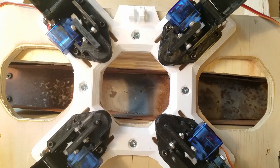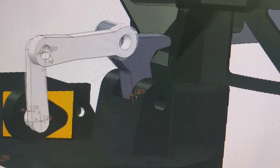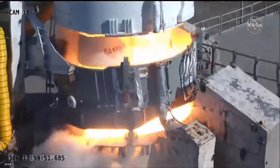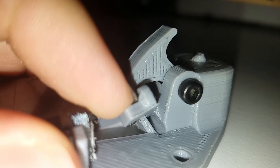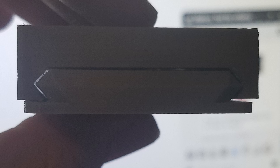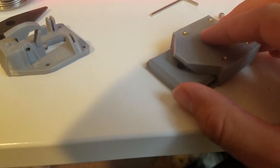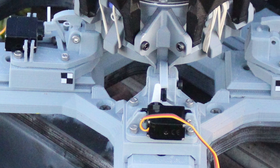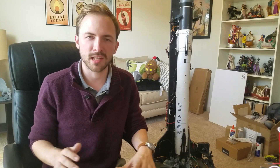Fixing the clamps required a complete redesign of the clamp system. The new clamps were based off the Antares launch clamps — I ended up stealing the launch clamp design as well. They use an anvil that reaches over and grabs an aft skirt on the rocket. The new launch clamp fixture is also a lot stronger and more adjustable. It uses a series of dovetail sliders to allow each clamp to move in and out more freely and adapt to different sizes of rockets. After a few tests, it was obvious that this new clamp setup was a real winner, so I mounted it and moved on to the next problem.